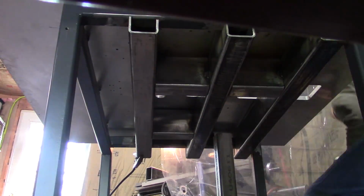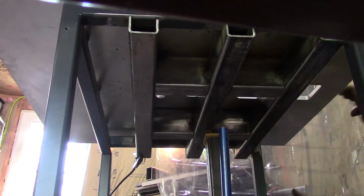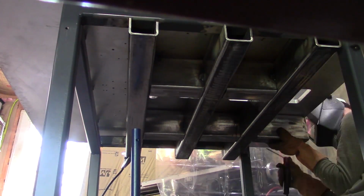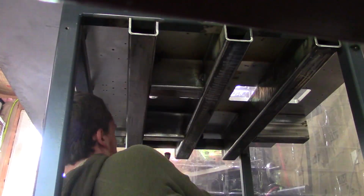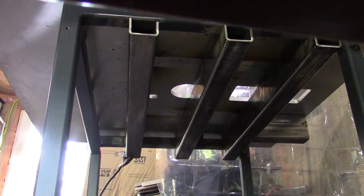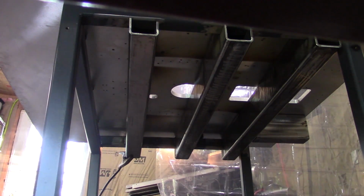I was having difficulty getting the supports to sit flush against the aluminum base plate. It turns out the cross members moved ever so slightly during the welding process, which wouldn't allow them to sit properly. I realized this when the front supports went in flawlessly because they aren't constrained by metal on both sides. So I went back to the mill to take several thousandths off each. I can always fill in the slight gaps with weld anyway.